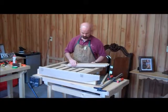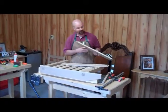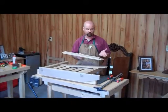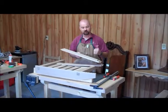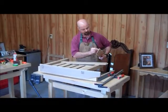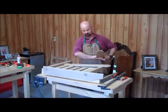So now I'll install the front rear rails in place. At this point, normally the cleats would already be glued on here, so you'd have a really good indicator of what the top inside face was. But I can always reference the little dot system. A single dot is telling me that that's the top outside face of the front.